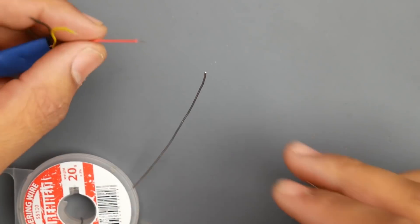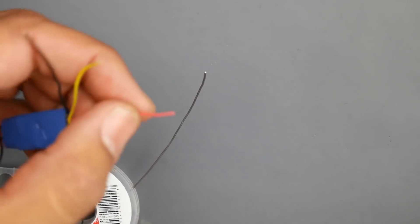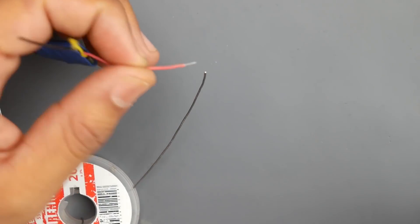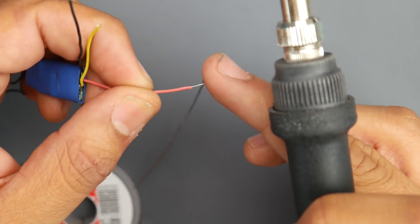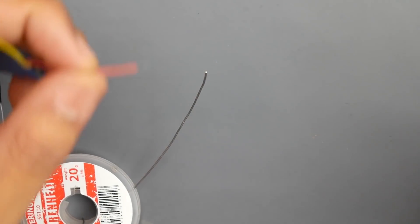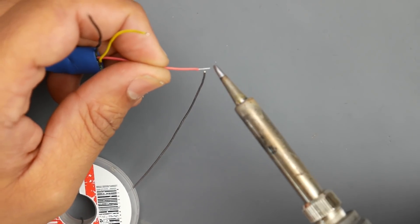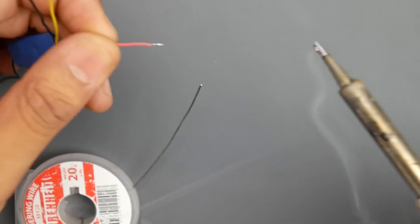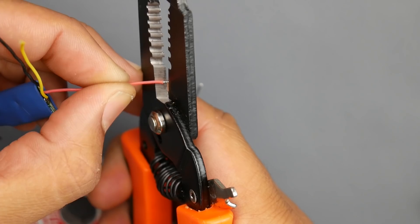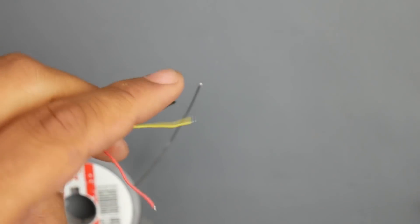The first step I always like to do is prepare all the wires I'm going to need. I trim them, twist the wire, and then add solder to it - I do that to every single wire before I begin. It's very important to twist the wire, or else the strands will go somewhere and short something out, ruining your whole build. I bring the solder in, just touch it like that, and that's it - solder added. Then trim the wires and they're all prepared.